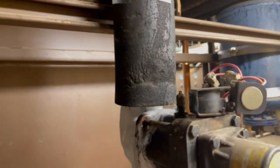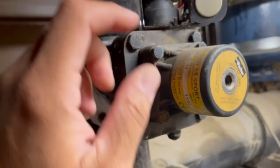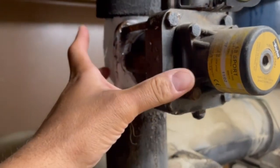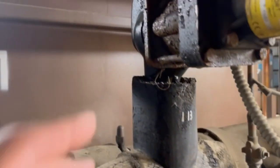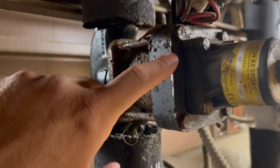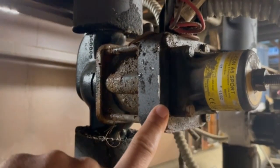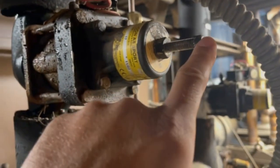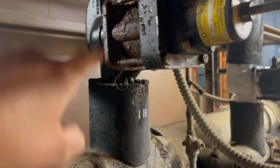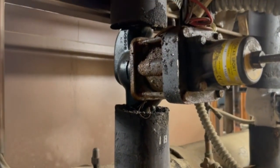My 1A is working fine - this is running off of rack pressure, that's why they took the nut out of here. This one is also running off rack pressure but this one's holding back pressure even though this is all the way stemmed out. I'm still holding back pressure here, so it's not running that rack pressure right now.